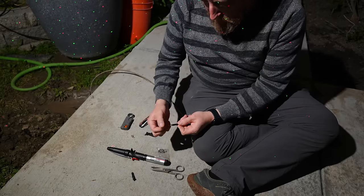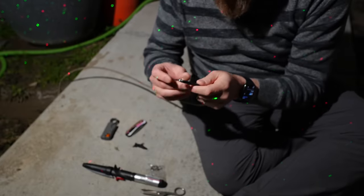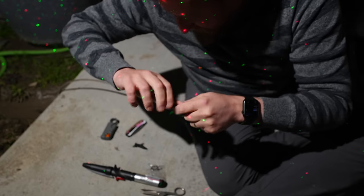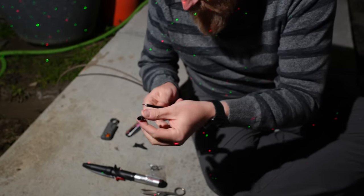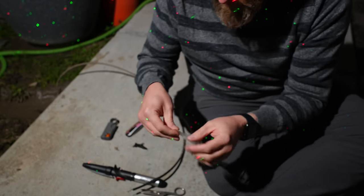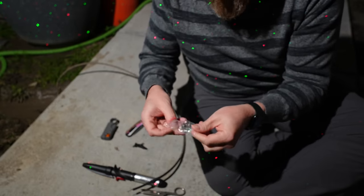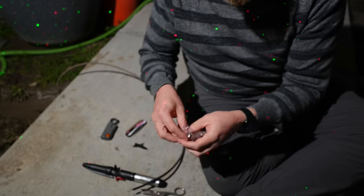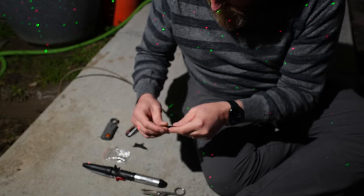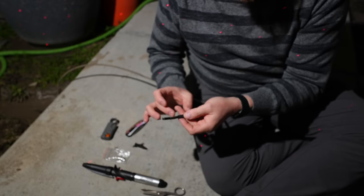There are our twisted elements, our braid, our shield. We need to add our heat shrink and the collet or collar of the connector first. If we don't do that and start messing around with the braid, we're going to have a hard time getting it actually all soldered and crimped at the end. So there are the two pieces: collar and heat shrink. I'm using the heat shrink for weatherproofing.